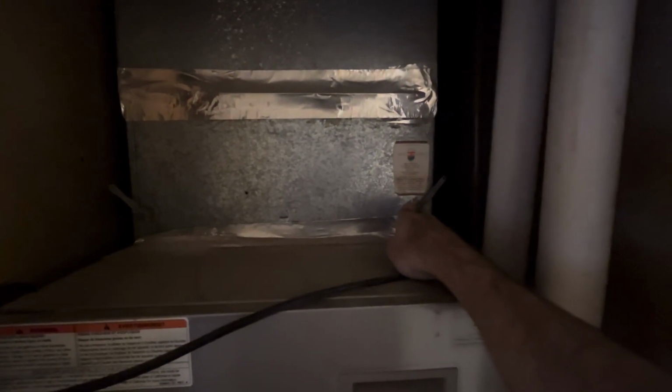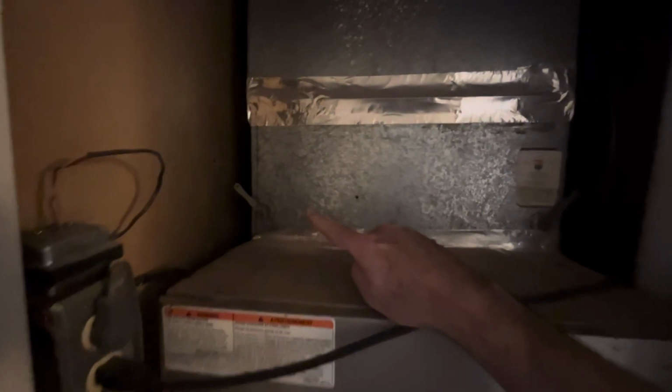And to do that, there's butterfly valves. There's a butterfly valve here and a butterfly valve here. There's 2 panels that sit in here and they sit open when the heater is working. I'm going to close them, and this one's gonna fold the other way, and that's gonna block access to the heater so I don't get cool, moist air blowing down into my HVAC system. It's gonna get blocked and it's gonna go into the rest of the house. So all we're gonna do is we're gonna flip that panel, flip that panel, the valve's closed, and we're ready to go.